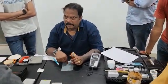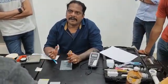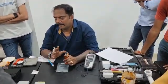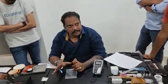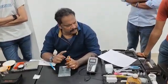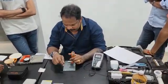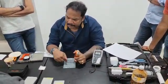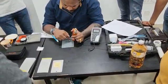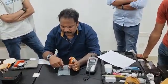Before doing the destructive method, make sure the coating is fully cured. You cannot do it the second day after coating is applied — if you cut it, it will come out, so it won't be realistic. Fully cured means it may be 6, 7, or 8 days. Check your PDS — product data sheet. Once done, put a reference mark in black or blue color.